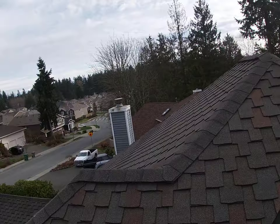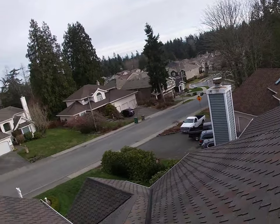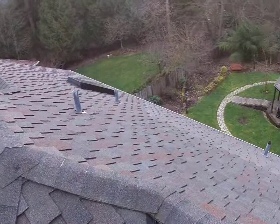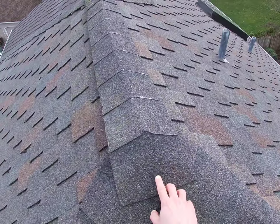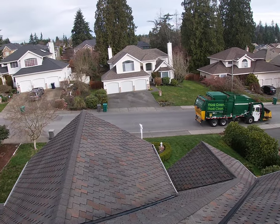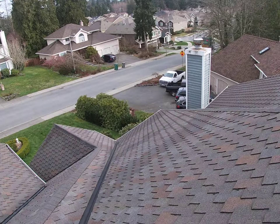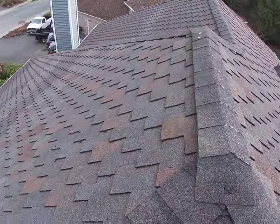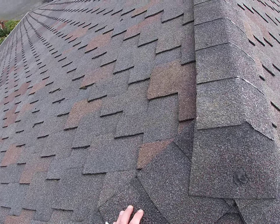This is a kind of roof inspection. We just checked the material. We also want to make sure there's no penetration, no exposed nails — if there are exposed nails, they are tarred, like these ones. This one is kind of old but it's still there. We want to make sure that the roof is in good shape — no cupping, no curl on the roof, and they're solid.